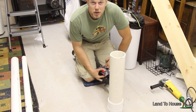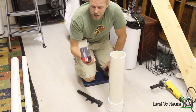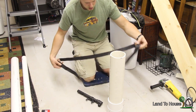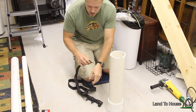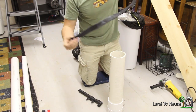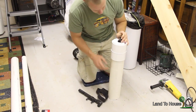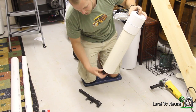Here's the step that most of you are looking for: the inner tube. For the 1¼ pump, I just use a 26-inch bike inner tube — it's nothing fancy. Turn it kind of inside out. Now, the stem — you want to make sure you put that in first, and that goes down here. All you have to do is kind of stuff this end loosely in the bottom.